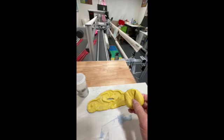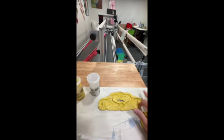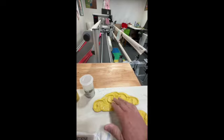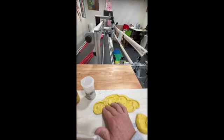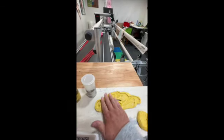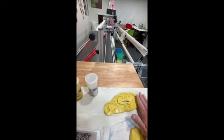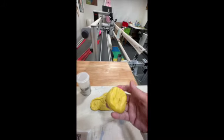I also needed an additional part that broke off, so I went ahead and cast that one. That one took a little bit longer because it was thicker. What you do when using this is dust it with some cornstarch once you've got your mold, then use air clay. The air clay worked out really well. You push it into the mold, press it down really good and hard to get all the creases and bubbles out, then wipe off the additional air clay so you've got a nice flat surface. I even turned mine over and pressed it down so that the side of the mold that pops out — the side that goes up against your furniture — lays very flat when you attach it to your piece.